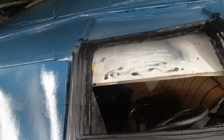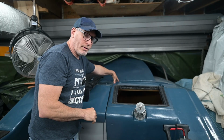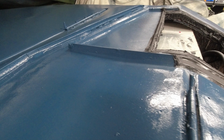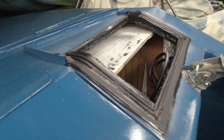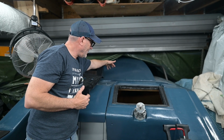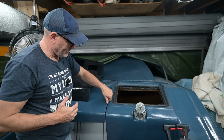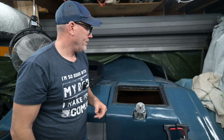I had to come up with a creative solution, and I decided that between installing this curb that I made, so this is a 1.25 inch composite board that has been cut and installed to the shape of the acrylic dash. It's been screwed, caulked, and painted, and that is going to be helpful in keeping any of the water that gets on the bow deck and diverting it down here and hopefully into this gutter, and on this side here and down the gunnels.